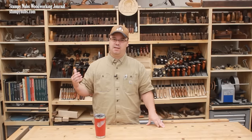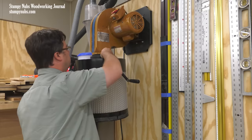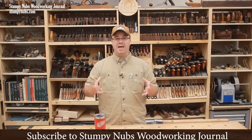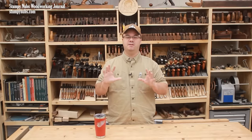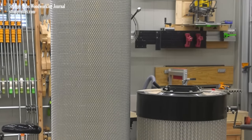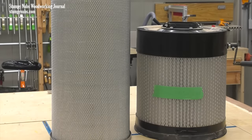That's why I like pleated canister filters. But these little canisters that go with these small dust collectors aren't big enough in my opinion, because when I turn it on, I can see that the bag on the bottom wants to blow right off. That tells me there isn't enough air escaping through the pleats in the filter. I like big canister filters with a lot of surface area so tons of air can flow through the system, giving me every bit of suction power my blower is capable of.